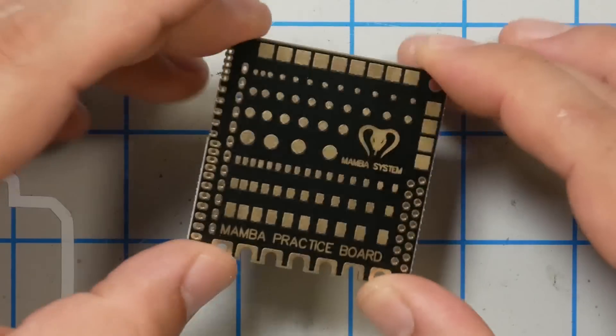So get this board, get some wire — some 14-gauge wire, some 20-gauge wire, and maybe some 26-gauge wire — and practice soldering to it. When you're done, desolder the wire, clean it up, and do it again. You can reuse this until you lift a pad because you've overheated it. But then thank goodness you didn't destroy a $45, $50, $60, $70 flight controller.